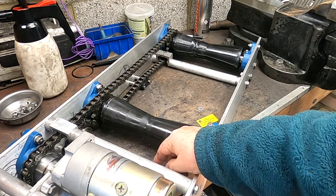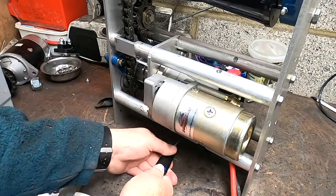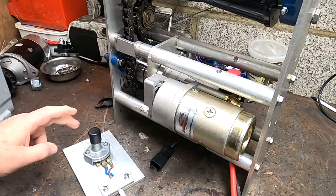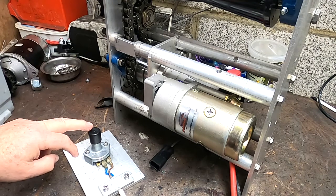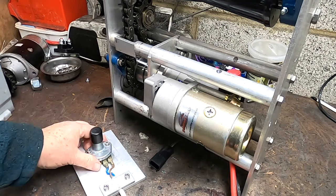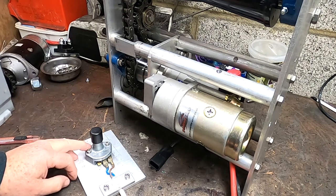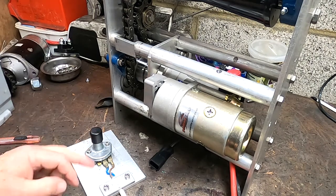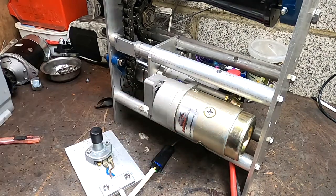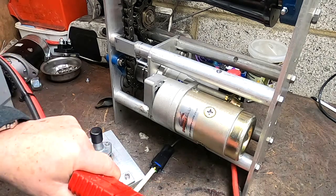Only to be drowned out by the racket the Velocette makes. It's now come to this stage — I've done a little bit of wiring. There's a little plug and socket, and this thing, this is the on-off switch. It's actually a click-on-click-off switch, a high and low switch usually mounted on the floor of a Mini. So it's just a convenient, robust switch which is used to having people put their foot on it. This is just a little plug and socket here that energizes it and works the solenoid. And this then is the two great connections for the motor.